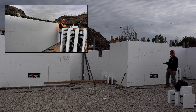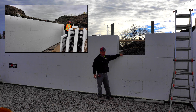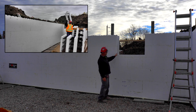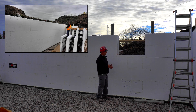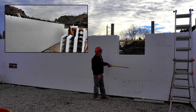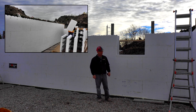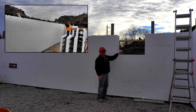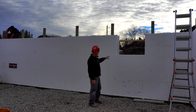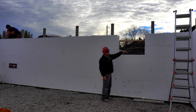We use a felt pen for marking the numbers. This is the only opening in this foundation that we're building — it's 36 by 26. What we do is add two inches to the rough opening, so we've cut this opening at exactly 40 inches. Take two inches off each side and it ends up being a 36-inch rough opening. We're going to use the fox buck for that — it's exactly two inches thick.